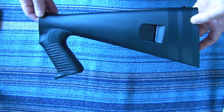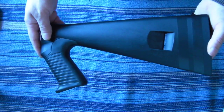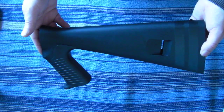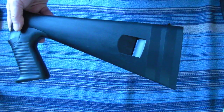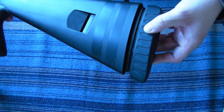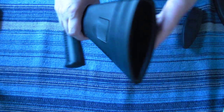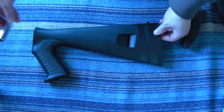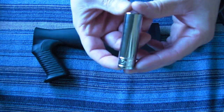Hello YouTube. It's a short video just to show you the shortening of my Benelli Supernova pump-action shotgun stock. This came with the factory stock. I took out the sling plate by pulling off the original standard Benelli recoil pad — that pulls off. There's a bar inside which extends to about here and goes through a little loop at the end of the stock, fixed by a 13mm socket — a socket I didn't have, so I had to buy that especially from Halfords.